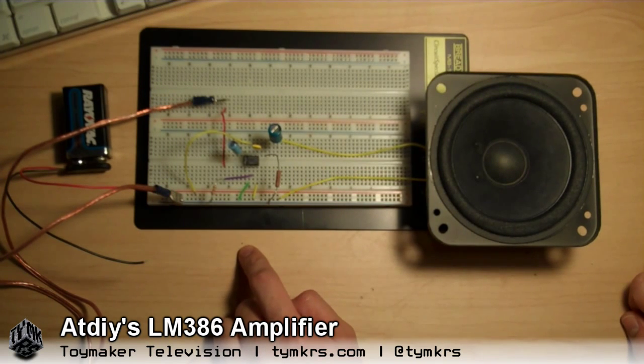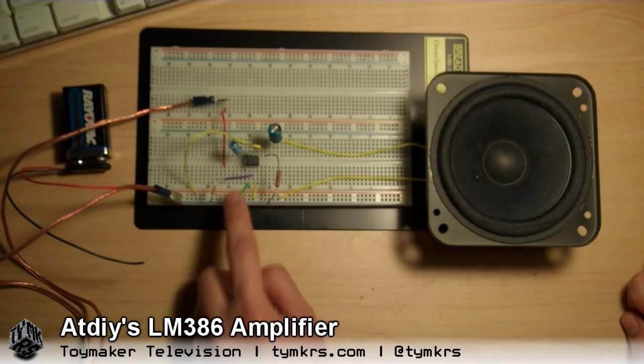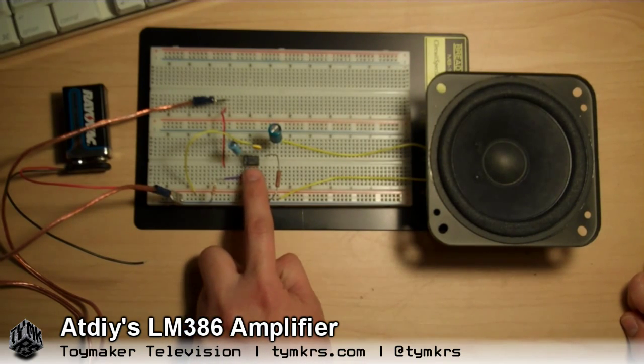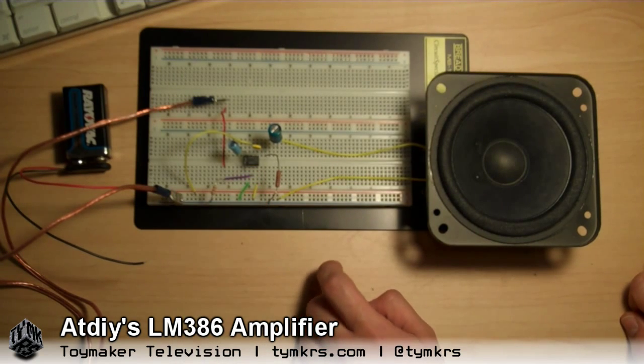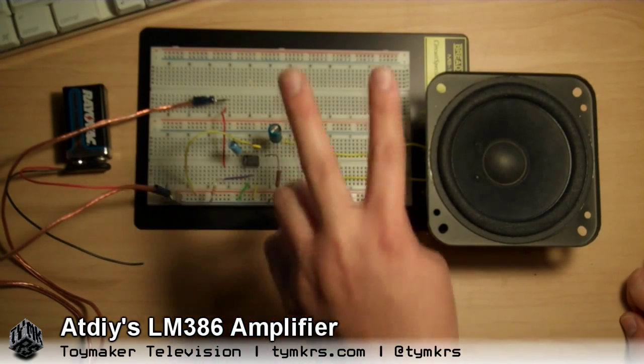What have you done here so far? I have made it — created it from nothing, well, part. So this is the LM386 chip. What's it do? It amplifies via op-amp action. It pretty much works by comparing two different inputs — the voltage difference — and then amplifies that voltage difference.